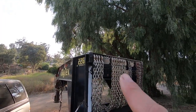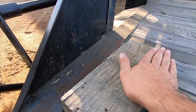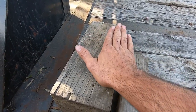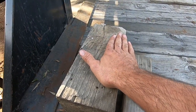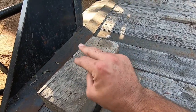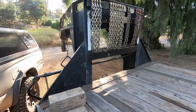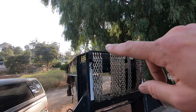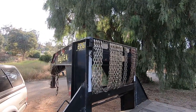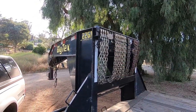which the mag drill has a safety on it where if it's not sitting completely proper on the piece, it's off a little bit, doesn't have a strong enough signal being fed back, like it's not drawing enough current, then it shuts the magnet off. Well, we had to get in there and twist a couple wires together, and now it'll turn the magnet on and start the drill no matter what. So had to modify the mag drill and then do all these little changes here. I'll find the footage of that and I'll throw it in there.